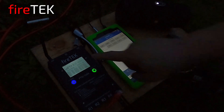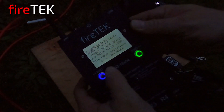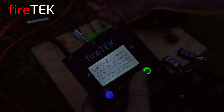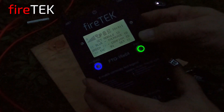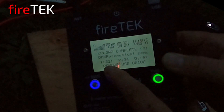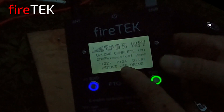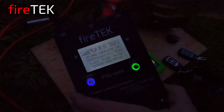We're going to go ahead and select ID1 — it's got no script loaded into it right now. We're going to put it into USB mode and insert our drive that's got the file for the show in it. We'll select that at ID1. There's our script: DMX Pyro Musical Demo — 221 events, 24 of them are pyro events and the remaining are DMX. We'll go ahead and remove this drive.